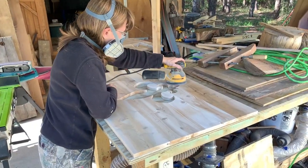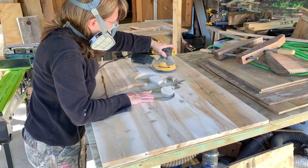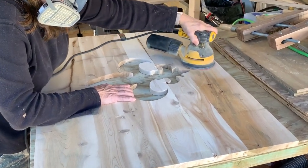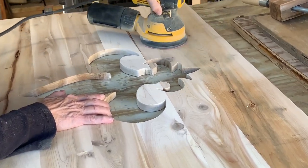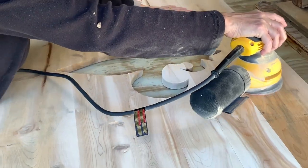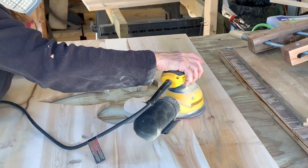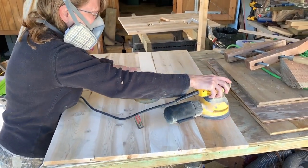After this it goes to the router table and combination sanding station. Start with like a 60 or 80 grit — you want to pull this down pretty good. You want to wind up with a good smooth surface to work off of because of the tape and epoxy pour coming later. Work up to at least 220 grit; that'll get your edges smooth for the epoxy pour. You can see the grain of the wood starting to come out real good — this white cedar from the Adirondack Mountains is really beautiful stuff. David and Elizabeth, you need to cut us some more of this!